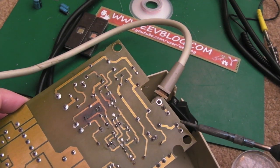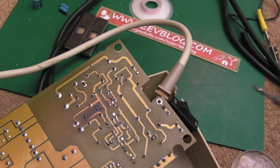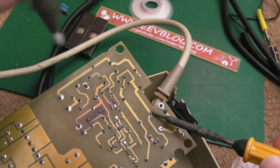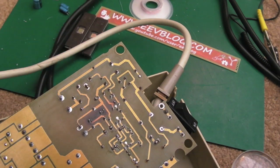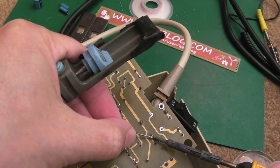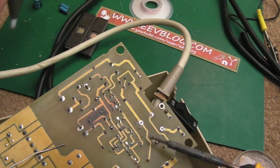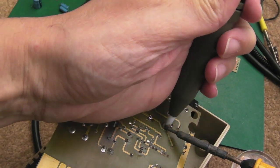It looks like the wiring, you know, the live comes in here, and I think it's supposed to go across there, this way, you know, across there. There should be a coil there and a coil there, I think. Unless I'm mistaken and it's not the kind of component I think it is. You know, it could be one of those varistor things or something like that. I don't know. I mean, I could see a current rating on it and a voltage, but I can't quite see the component designation on the board and stuff, and it's not the sort of thing I've had to swap out for a very long time, actually. I've certainly never seen that fail on one of these power supplies before like this. Maybe in other equipment, but never an Amiga power supply.